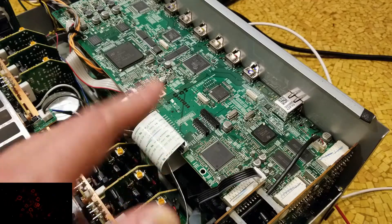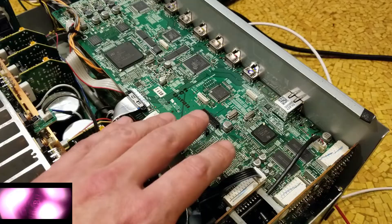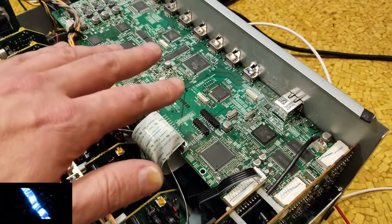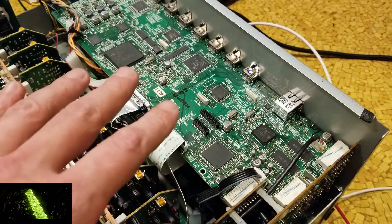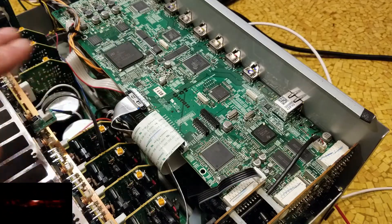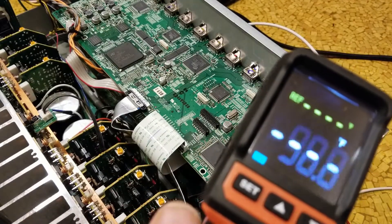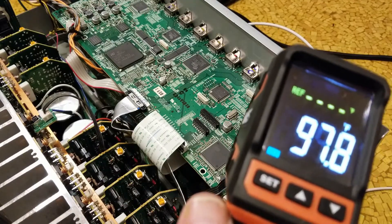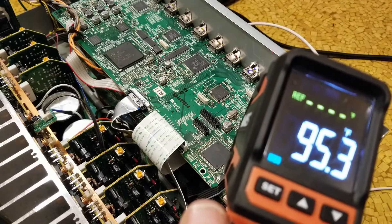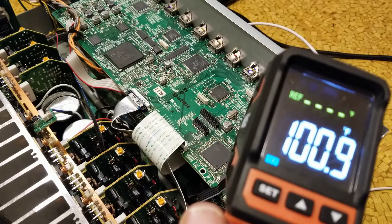Quick update: so far it's actually working. That was the actual fix. I went back and made sure I got that chip to at least 375 degrees Fahrenheit. I haven't tested the HDMI switching, upsampling, networking, or any of the digital stuff, but it does put out audio left and right — pure direct mode works, so we're making progress. But I wanted to show the root cause: both of the CPUs really need heat sinks. This little chip has been on for 10 minutes and with the case off it's already over 100 degrees.